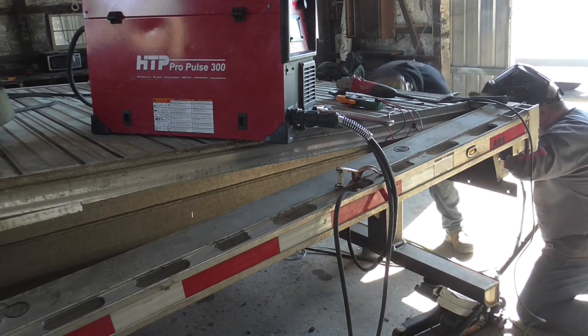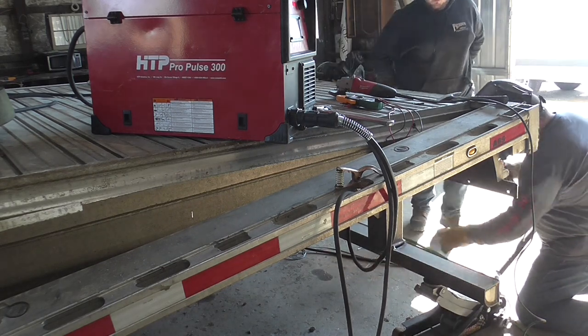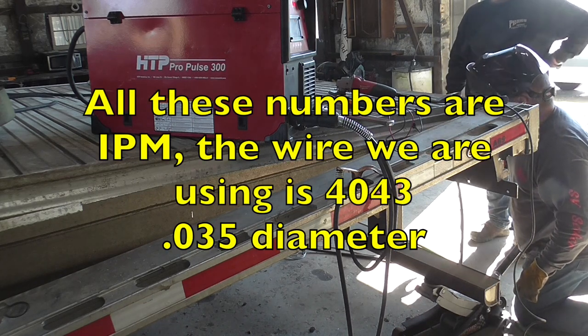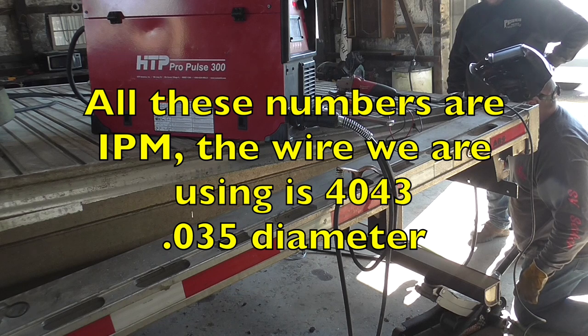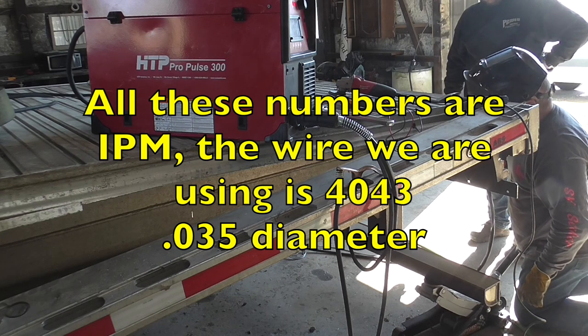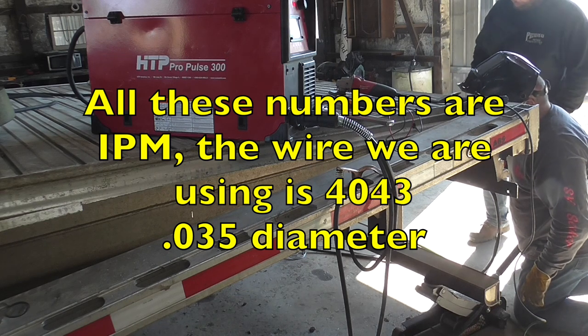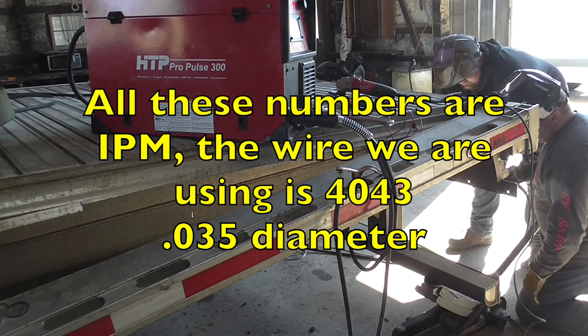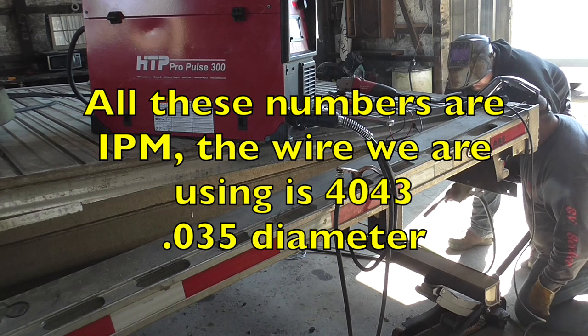I'm gonna leave you a little bit fun. I mean, you can still wire brush this now and then do a bigger weave with a little bit more juice. This is 279, just for reference. Because when I started at like 320, it was too hot, and then I just pulled back till, yeah, you can just walk this forward and wash and do whatever.